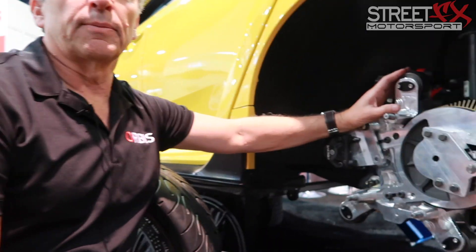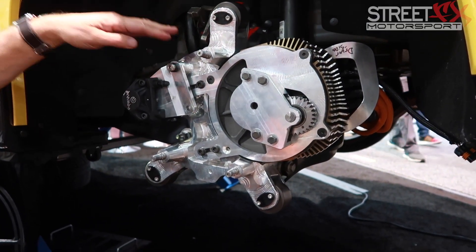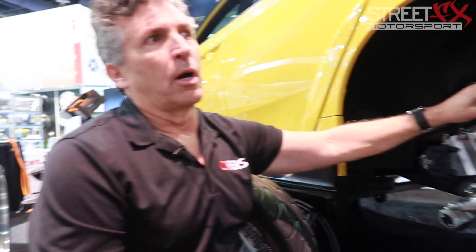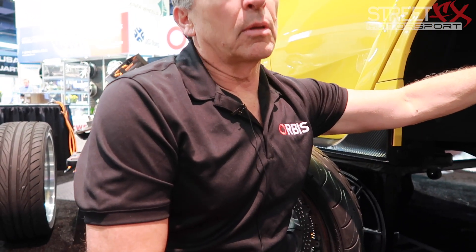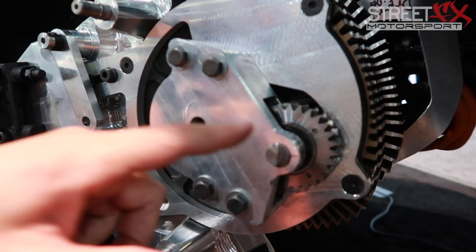This is otherwise a factory vehicle. When you add the battery pack you're going to increase curb weight, however the Honda had a front-to-rear bias of 62:38, so we put the battery in the back of the car and corrected that to roughly 57:43. Even though we added about 200 pounds to the car, we improved the zero-to-60 by 0.6 seconds — that was Motor Trend's finding. That's with gearing built at 120 miles per hour of assist, so we can change this ratio.